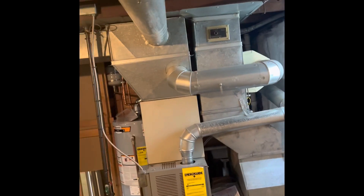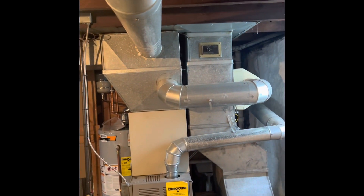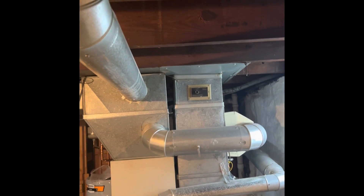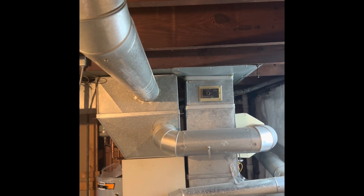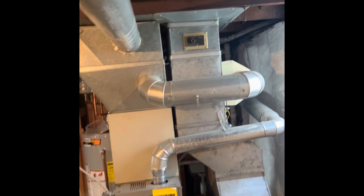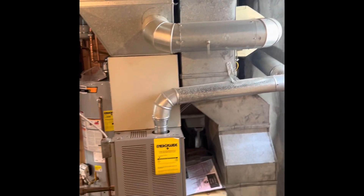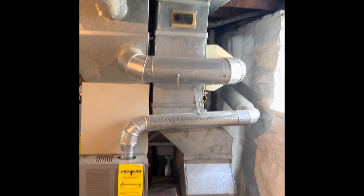Return drop's going to get rebuilt. We're going to do a box on the return drop — a new box up there to span those two joist spaces. It needs to be 35 inches from side to side, 8 inches tall, and 10 inches deep, with a 10-inch drop. We should be able to push all the way up against the edge of the joist there, giving us enough space for our filter cabinet. Maybe we'll have to put a 2- or 3-inch offset in the drop — I'll get some measurements for that.